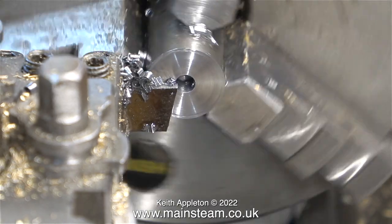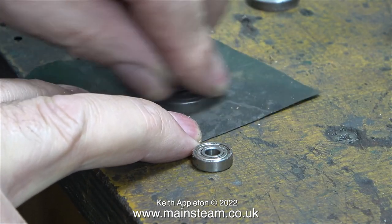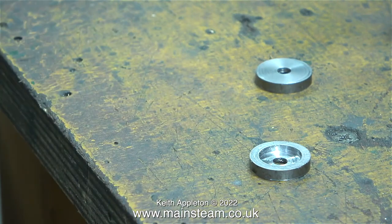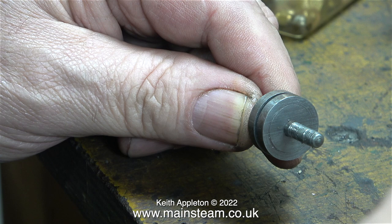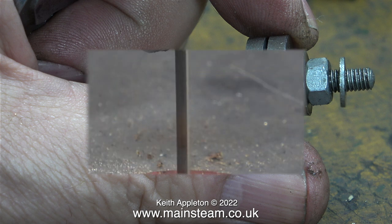After parting off the second recessed washer, I cleaned up both of them on a piece of wet-and-dry sandpaper on the bench. Yes, I do know I should be using a surface plate, but this will do the job. Now the ball race fits inside the recessed washer, and all I need to do is set the gap. I need one washer less than half an inch in diameter at each side of the ball race, and once bolted in position the washer will only put pressure on the centre part of the ball race, which will allow it to spin freely inside the recessed washers. I think this should do the job even better than the original once it's all bolted back into position.